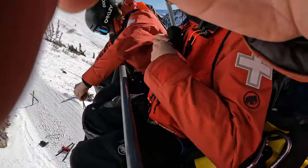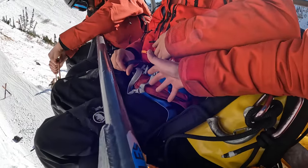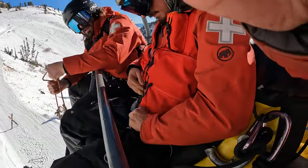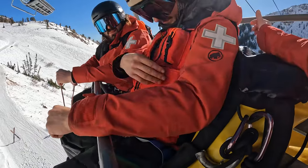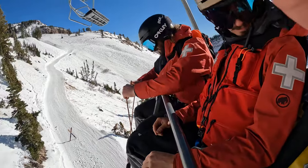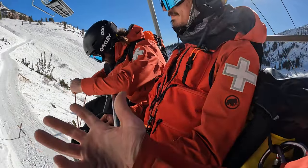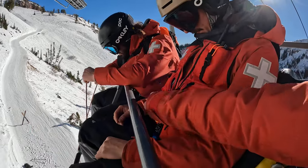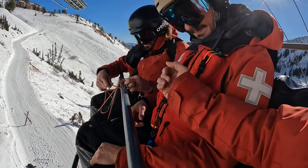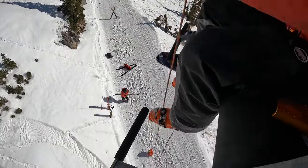Since Will is our rescuer, he can start harnessing up. We all carry seat harnesses that we can put on while seated in the chair without removing anything. We're in an industrial environment and the reality is we won't have full body harnesses up here — trying to put one on in this environment would arguably be more dangerous. The kit we haul up has a chest harness adapter with a rated sternal arrest point that connects into the belay loop, effectively converting us to a full body harness on the fly — a good compromise.